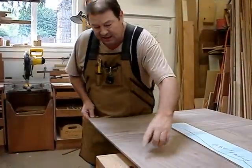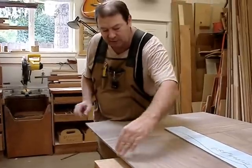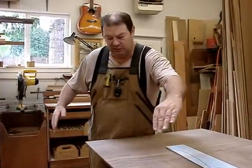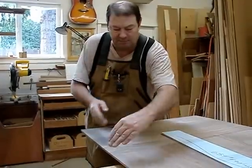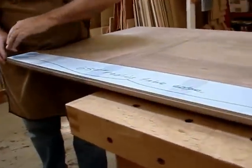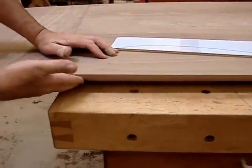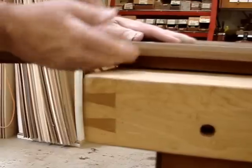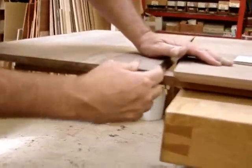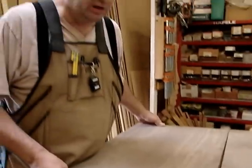If we hadn't done that, this wouldn't have been such a nice flow through here — it would have either dipped in here or peaked here. But it's not; it follows the radius just so. The leaf fits like that. Then we beveled the bottom edge, like mid-century modern often does, and made the leaf to correspond so that the joint rules in — it's kind of a modern rule joint almost.